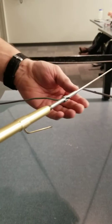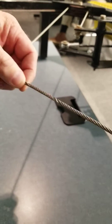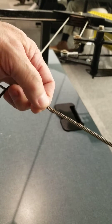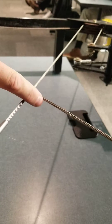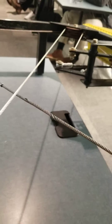I also mentioned we talked about cables and looking for damage. Here's a great example of damage to a cable — this cable has been twisted. You can see how it's no longer nice and smooth; someone has taken one of these cables and unwound it so far and then tensioned it up, so it actually started to unwind the cable. If this was in an airplane, you would replace that cable.